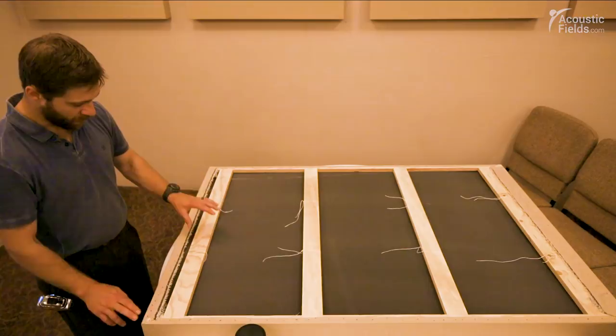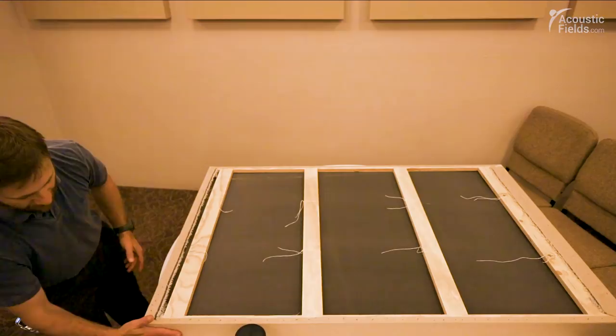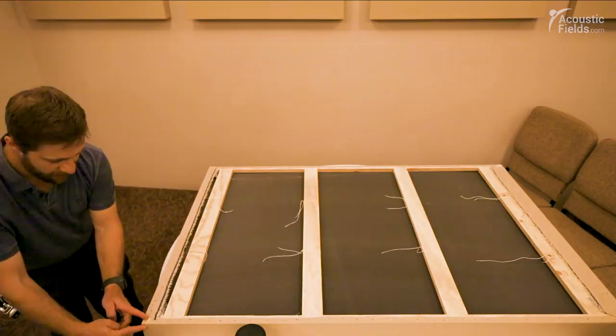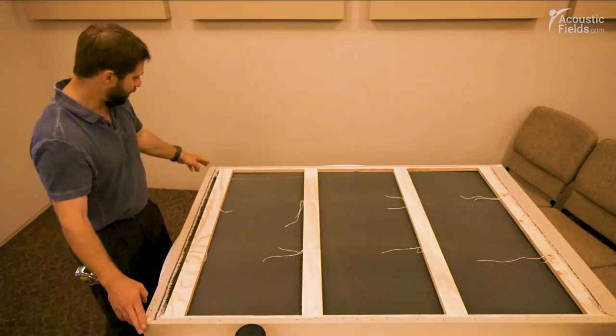What we've done is take these strips of plywood and build a box. We have four pieces, two on each end up here — you can kind of see here, they run this way, and then these run this way. We join them together with glue and screw them in with a two-and-a-quarter or two-and-a-half drywall screw, which worked good for us.